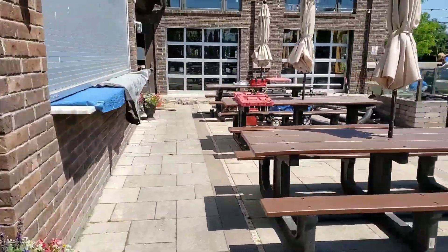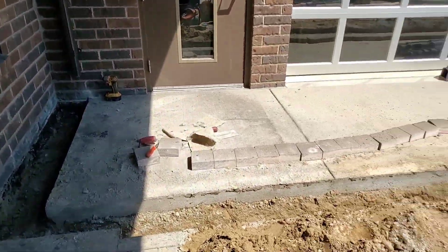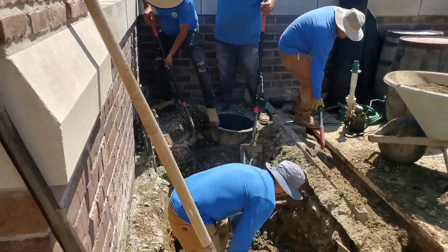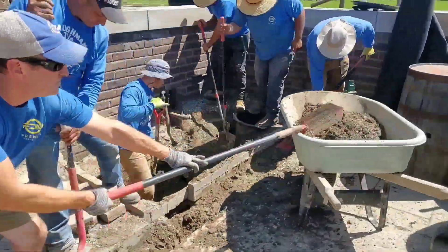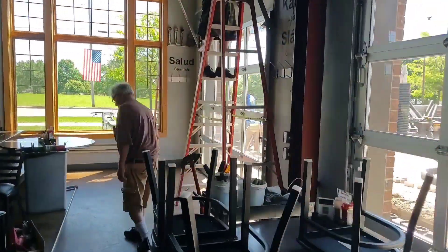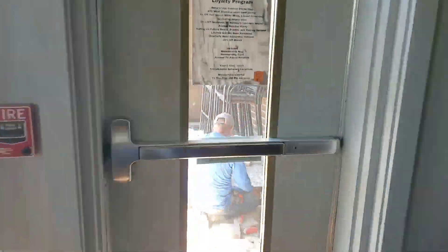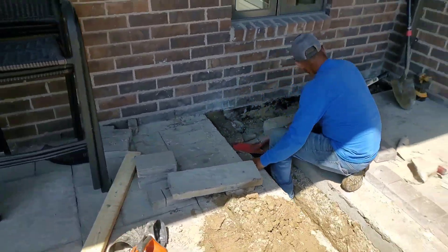You can see that this outdoor courtyard is huge, so how that little indoor sump pump basin was going to take care of all that surface water and sheet water coming off that courtyard area is beyond me. We're going to dig a really big sump pit. We're going to install one of our Screamin' Demon sump systems along with one of our Bad Seeds. We're pulling power from two different breakers — two different plugs — because I want the Screamin' Demon on its own breaker.